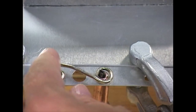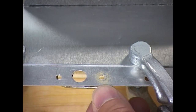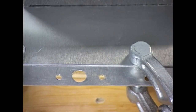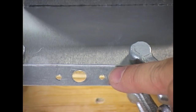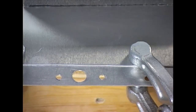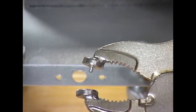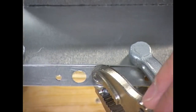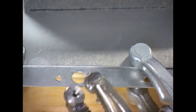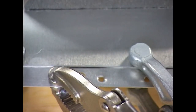What we are going to do now is remove the spring. Since the spring is actually going to go underneath and we are going to rivet from the top, we want to dimple these two holes — because our cover is going to come down and we want it to go down flat, so we can't have bumps from our rivets sitting in these two holes. So take your dimpler — I have one of these vice grip type dimplers. You may have a squeezer type dimpler; it doesn't matter as long as you get the dimpling done. I am going to come in here, give that a squeeze, and give that a squeeze.